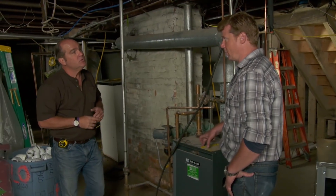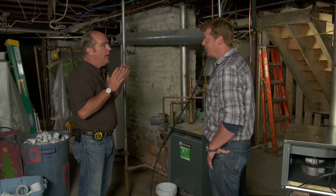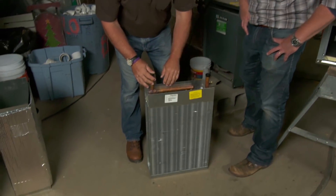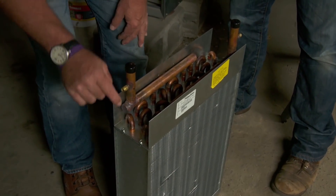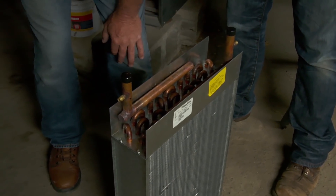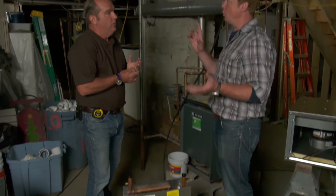Boilers make hot water, but you're talking about a ducted system, so you've got to make that connection. We're going to use hydro air — hydro for water, air for air. It's the equivalent of an automobile radiator coil sitting in an air handler. Heated water will go through the coil back and forth, and air will be drawn across that coil to heat the air in the winter. So those ducts we install will give us heat and cooling all in one.